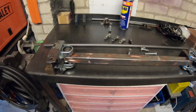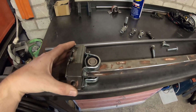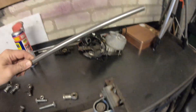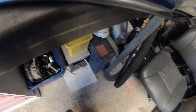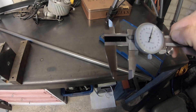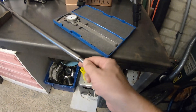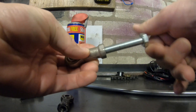I've almost got the front axle built for the reverse tricycle. With it being a reverse tricycle, the front wheels steer. I'm just going to use these ball joints and connect them onto there. I've got this — I can't remember what diameter that is — it's a 14mm mild steel pipe, but it's there and thereabouts 10mm internal diameter. So I'll put that thread over there and weld it around there, and then these ball joints will go in there like that.